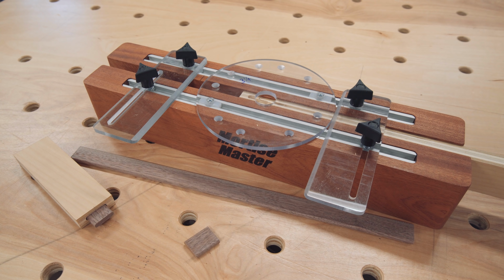Here at my assembly table is another handy setup. I've got the piece clamped in with an F-style clamp. And over here on the edge, I can use a parallel clamp or any other clamp for that matter. Stick my knee into it at the bottom to hold the bottom of that. Slide this around so it's hanging off the work table, and then clamp it in place. And with this setup, I'm fully supported by this clamp over here as I'm working on the jig. And I can grab my router, make my mortise, set it back down. And I have both hands available to work with the material and this clamp over here.